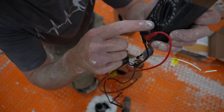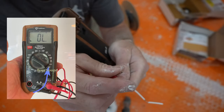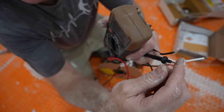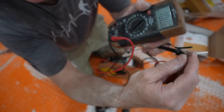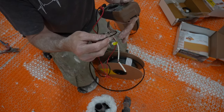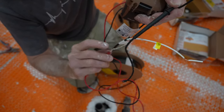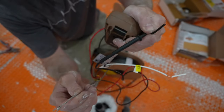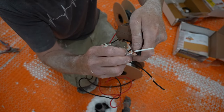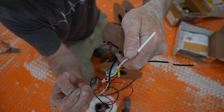The second test uses a buzzer — you put it on the buzzer setting and it makes a sound. To confirm the buzzer is working, just connect the two leads together. Then you test each cable: put your black wire to the ground and test ground to one of the cables. If you don't hear a buzz, you're good. Same for your white wire — test the ground to your white wire, and if there's no buzzer, you're good.